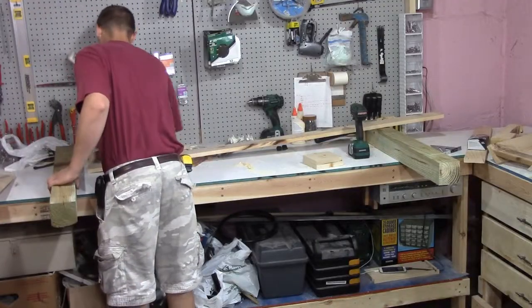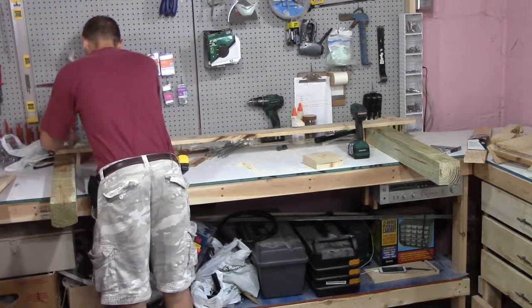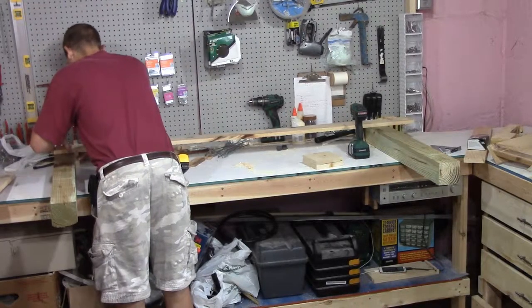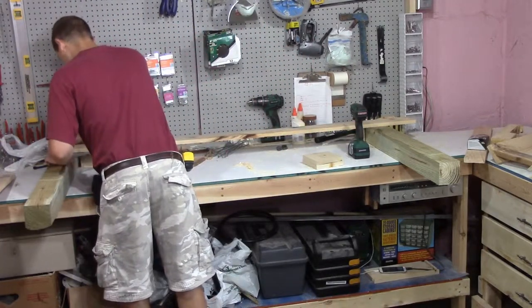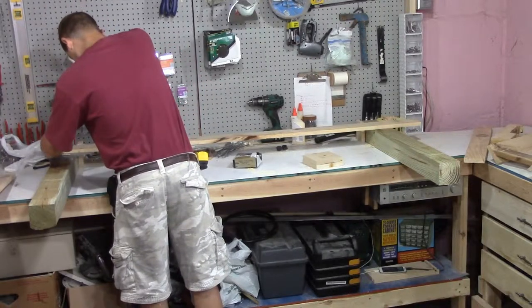I joined the 4x4s to the 6 foot 1x4s in my basement. It's always easy to work with a workshop — I have all the tools down there already. Unfortunately I couldn't do the full assembly in the basement as I would not have been able to bring them up the stairs and through the door. The top board I mounted about 3 inches down from the top and then left about a 6 inch gap between the next board.